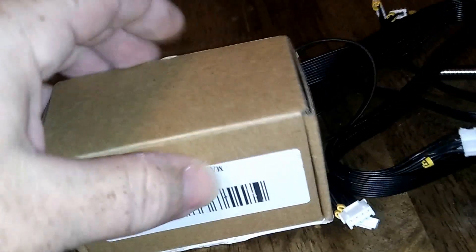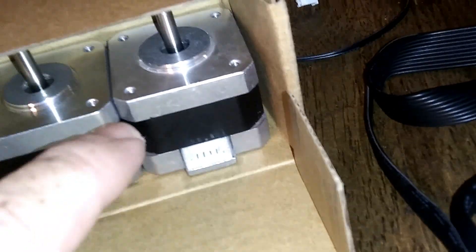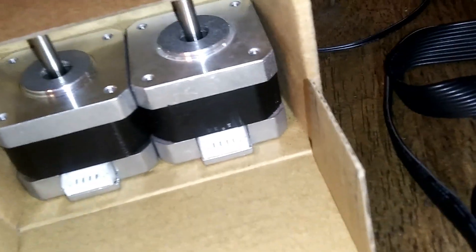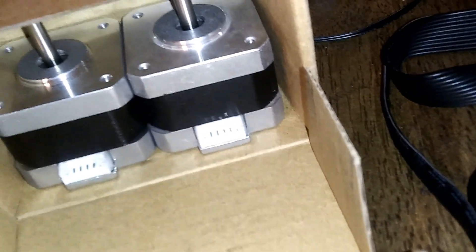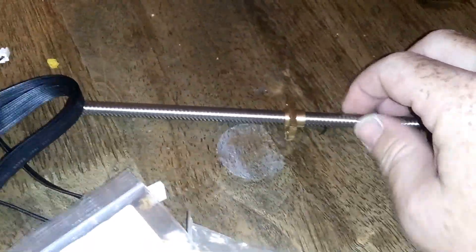So initially I bought not one but two motors, because that's what I thought it was. When troubleshooting, I checked everything. The wires looked fine, the connection wires were fine, and I laid the Z screw on the table and rolled it — you could tell it was straight as a whistle. My troubleshooting led me to believe the motor was going out, so I ordered a brand new one and it did the same thing. I ordered another one, and again the same thing. Three motors doing the exact same thing — you know for sure it's not the motor.